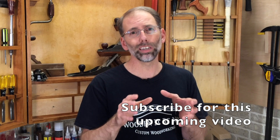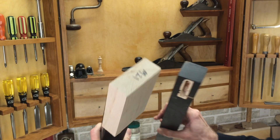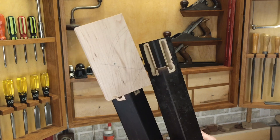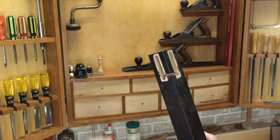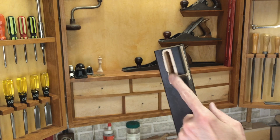I'm going to switch gears to an easier example — something where I can show you how to do the shaping and the joinery to repair a broken piece of wood. This is a bench that had a problem when it was built. It broke off, so I've laminated some maple to it. It was designed in a way where the joinery was very weak. These mortises were just pulled apart because they had cut a piece in here and they were too short at the top.